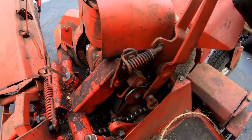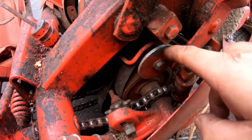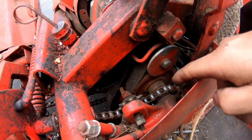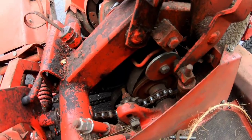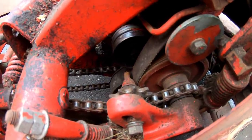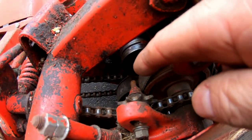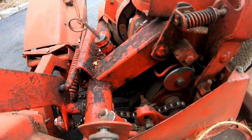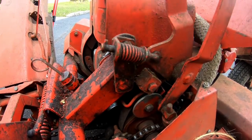If you look at the lever here, right, here is the clutch. Look how it works. To go forward, there's a pulley there with a thick belt that goes around the crankshaft. Right now there's slack on it, so it won't go anywhere. When you're ready to go, it turns this, turns the chain, and I guess it turns the wheel. Same concept goes on the other side, where there's a pulley, a tensioner arm, that gives tension to the inner belt, also about an inch or so, inch and a quarter wide. And then that engages the pulley down there that turns the chain that spins the reels. So pretty cool. Belts are all there, and the mechanism that's used to engage both pulleys seems to work properly.